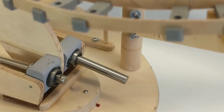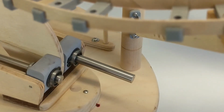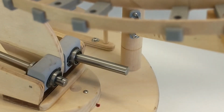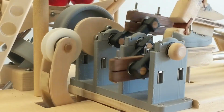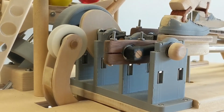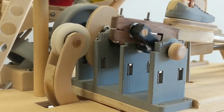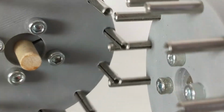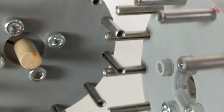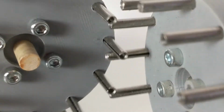Here at the end of the elliptical pedal assembly are linear bearings. They're ball bearings inside of a sleeve that permits linear motion. The crankshaft assembly is sitting in a 3D printed pillow block, so there's a 4-journal pillow block. Crankshafts, partially 3D printed. And then pinwheel gears that were 3D printed and into which I've installed 1-inch long, 1/8-inch diameter stainless steel roll pins.